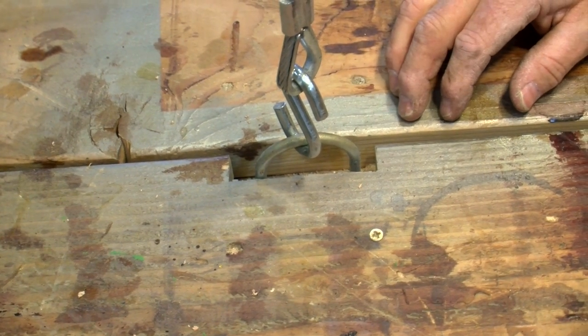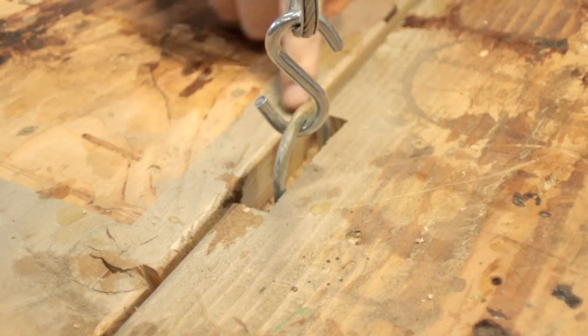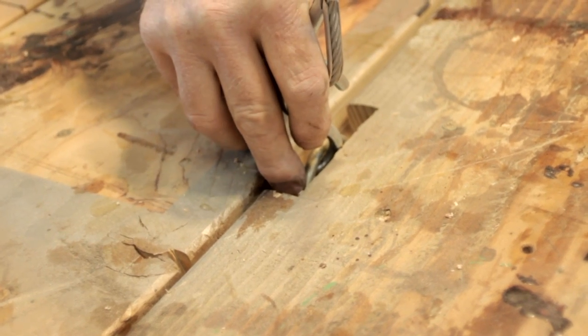One trick I use to keep the U-bolts from protruding through the bench when you're using the bench was to cut slots in the 2x12s so that when there's no weight on the bench and they're not being supported by the cables, the U-bolts drop down into the grooves and aren't protruding through the surface.